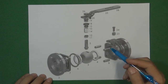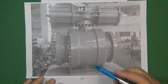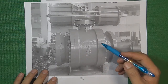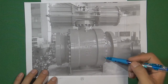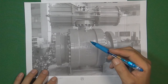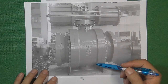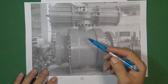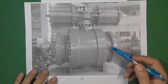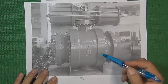So, what kind of design can accommodate very large ball valve sizes like 20-inch or 14-inch? Here is a very large ball valve — a 32-inch, Class 600 ball valve. For this size, using a two-piece valve body is impossible, because gravity would force the heavy ball to damage the valve seat. So we need to fix the valve ball in the middle part of the valve body, and then connect another piece to the middle part. We call this design the three-piece ball valve — three pieces of valve body connected together.